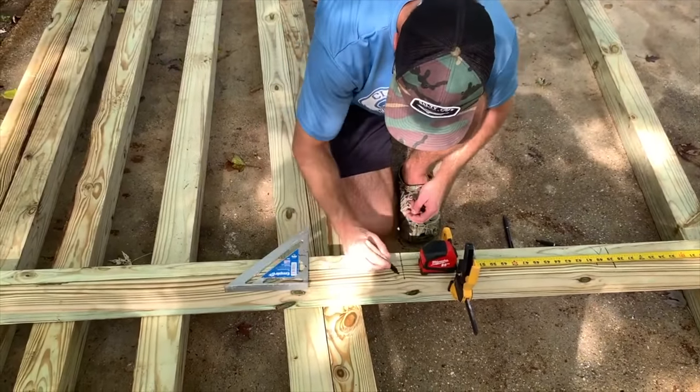I didn't do that here because I had the luxury of a helper who could hold the wall while I got the adjacent wall positioned in place, but I highly recommend that you install that brace if you're doing this alone or even if you have a helper. That really is the correct way to do it.